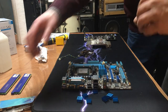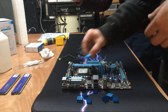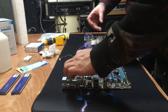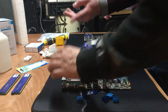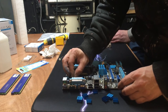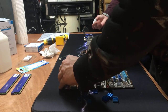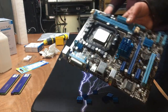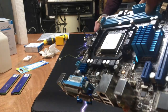They do come with their own adhesive. Nice Chinese instructions. These might be too big — yeah, they look a little large. But we could make it work nonetheless. They're just a little big — that's fine. It'll just be utilizing about 80% of the heat sink itself. You don't want them to short and hit other stuff. We're going for overclocking and outfitting this board with something like this — it could mean the difference between life and death. We're adding additional thermal heat sinks to the board.